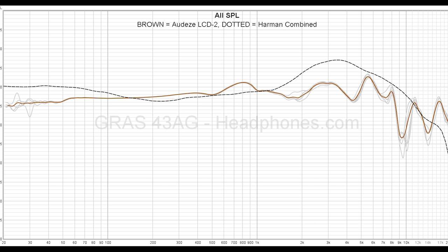Overall, what does that mean for the frequency response? It's not about a poor tonal balance — the tonal balance is actually appropriate for the shape of the curve. It's really just that where the brain expects an elevation, there's just not enough — in fact there's none. If there were even just 3 or 4 dB extra energy in the upper mids between 1.5 and 4 kHz, the shape would be totally appropriate. The balance between fundamental and harmonic is totally fine; it's just that the muted, subdued upper midrange means you lose clarity. The sense of overall clarity and resolution is lacking as a result of its frequency response.